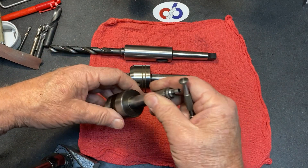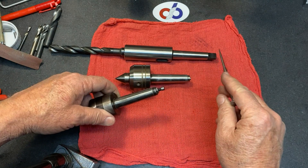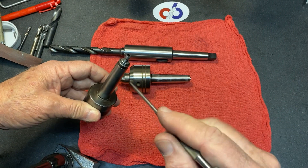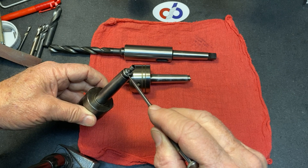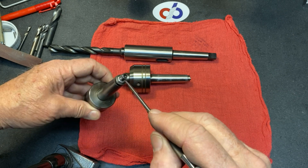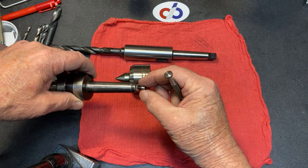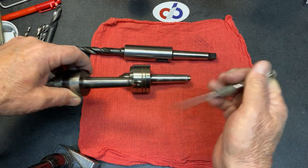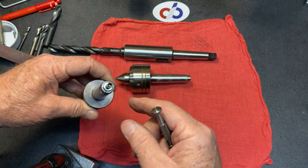This is a Japanese one, and I had a problem — without the ejector tang, this unit wouldn't eject. The simple fix was to basically drill and tap it, then have a lock nut and machine an Allen head bolt so that it fits into the receiver in the tailstock. Then the ejector pin presses it out when you want it out. It's kind of ugly but it works.